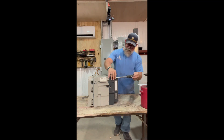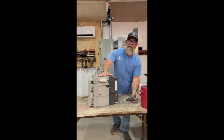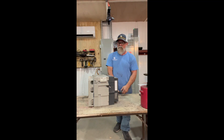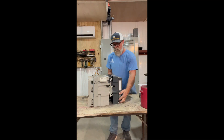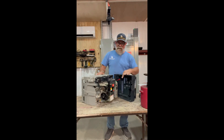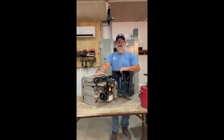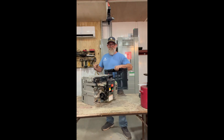We get asked questions all the time about different breakers and different sizes. A lot of people get mixed up between breaker types. Essentially, you have a molded case breaker, which is a plastic body breaker with a switch on and off. Then you have the large air circuit breakers, which have an open-air contact with a large beefy mechanism. Then you have the insulated case breaker like this one — it's almost like the molded case breaker and the air breaker had a baby. It has a plastic body but still has a steel mechanical mechanism for operating the contacts open and closed.